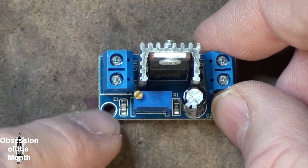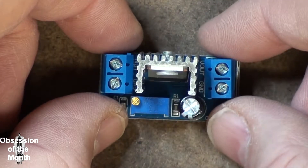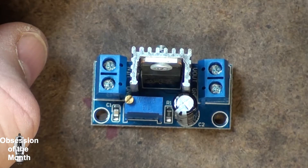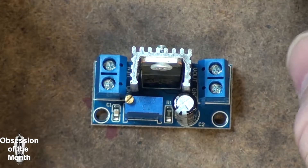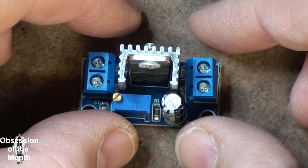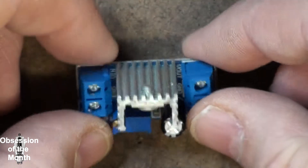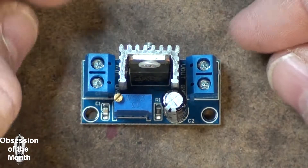Adjustment on this one is done by this tiny little pot. I haven't used any of these, but basically what I would use these for is if I wanted to power a small project and needed a specific voltage, and I wanted to be able to use just about any AC adapter — you just put this in there, set it for the voltage you want, and then it doesn't really matter too much what you plug in. The only thing is this heat sink is extremely small, so I wouldn't put it on high amperage loads — maybe only 500, 600, 700 milliamps. It's one of those things where you set it and forget about it.